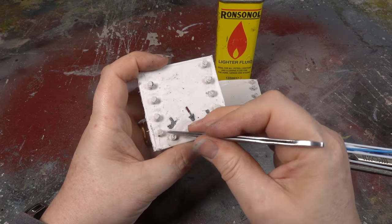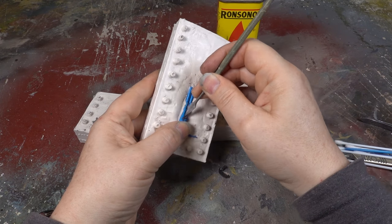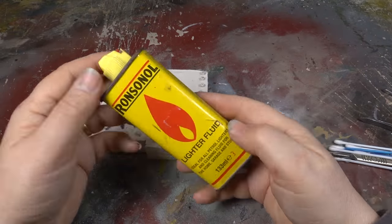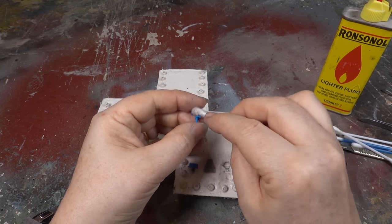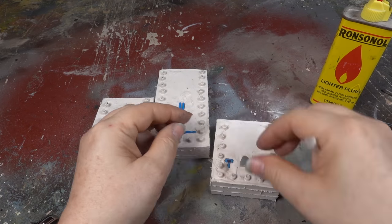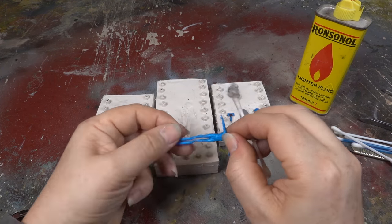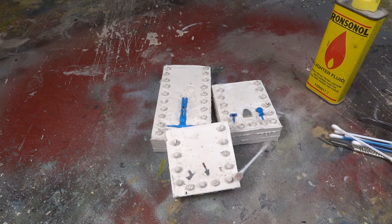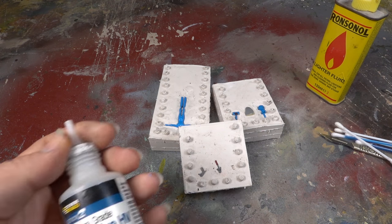Excess silicone that crept past the plasticine is now trimmed away, and any loose plasticine is picked out before cleaning the mould down with lighter fluid to remove the plasticine residue. Sometimes the masters become dislodged. This often happens with small parts. They must be secured back into the mould, with small amounts of superglue to hold them in place.